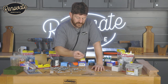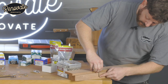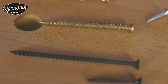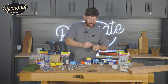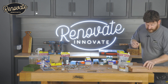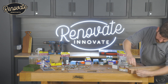Now we're going to talk about length of the screw and how to choose the correct length for your application. The best idea is that whatever you're screwing into or through, you want the screw to penetrate more than halfway into the bottom piece of timber. One of the main differences in screws that have thread running all the way to the head or not is the type of material you'll be using. A chipboard screw will have thread running all the way along, same with MDF. But when you're fixing hardwood or softwood, the reason why there is no thread at the top is so that as your screw comes down and pulls tight, it's pulling the pieces together — not just pushing — so you get a much tighter fix.